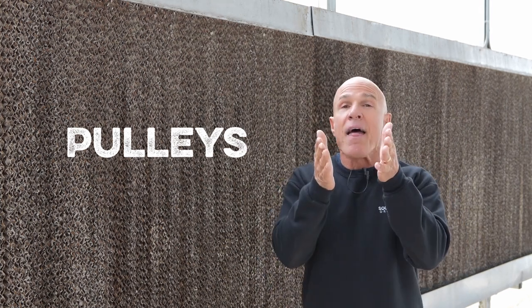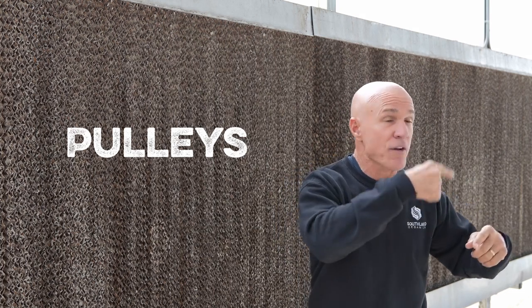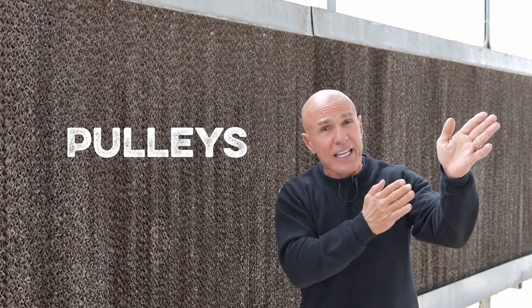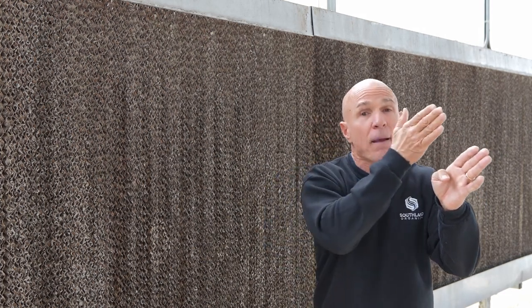Number two, your pulleys. Pulleys are a crucial part because a pulley can start wearing out and that belt will drop down in there. That pulley should have a V-shape. What will happen is it wears down to where it's making that V into a U, and when the belt starts riding down in there, you start losing a percentage of that fan turning, which means you're going to lose airflow. Make sure your pulleys have got a good V and aren't worn. Also check alignment — that's one thing that can wear out those belts, and it can come from a motor getting loose or pulleys getting loose. Keep those pulleys in line, or they're going to wear out the belt faster. Make sure your belts are riding where they should, your pulleys are lined up, and they've got a good V cut into them.